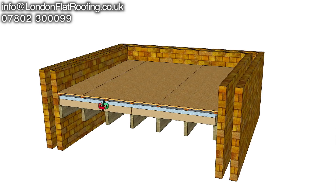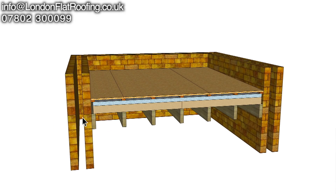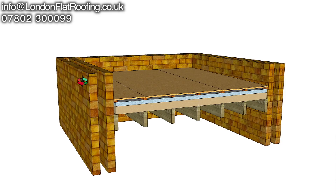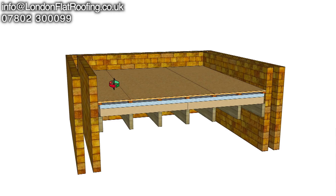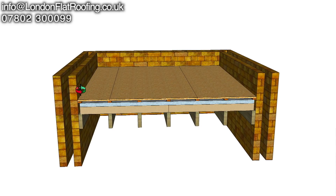Now let's look at the cavity wall scenario. You've got a cavity wall closed at the top and full of insulation, and we know the pointing along the outside isn't particularly good. We also know the coping stone on top isn't throwing water off either side, so we've got water running down both sides of the wall. When we looked inside there was a lovely lead flashing and under the lead flashing it was dry, so I'm not too concerned about the water running down there — though it all still needs to be changed. I don't think the water running down the wall was what caused the roof to rot on the inside at the edges, because it was bone dry on the wall yet wet underneath the roof all the way along. However, this wet area means moisture could have been transferring through, which certainly wouldn't have helped the situation.